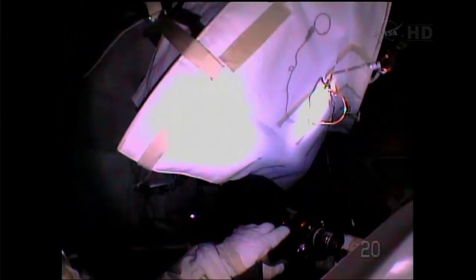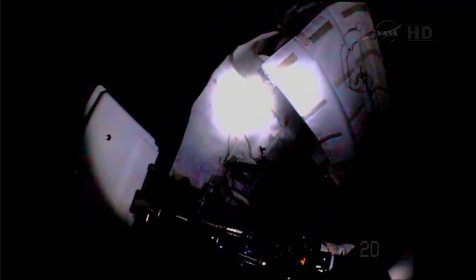And Chris, you're going to drive the center fastener first, 28 to 31 turns to torque. 28 turns on the center. Copy that, Shane. Double checking Alpha 1, clockwise 2. Good settings, Chris. And I've got the PGT on the center bolt. Here we go.